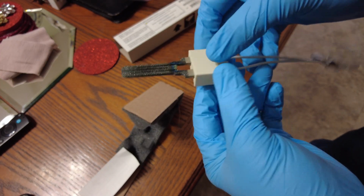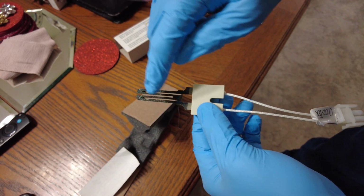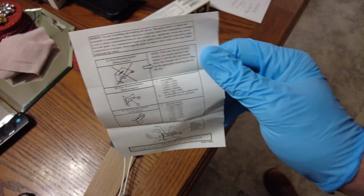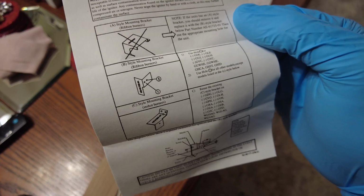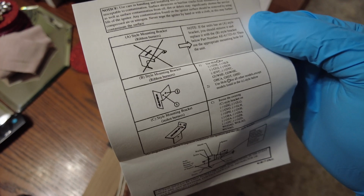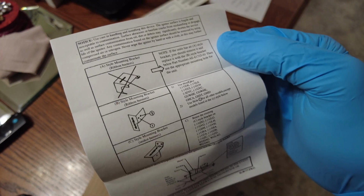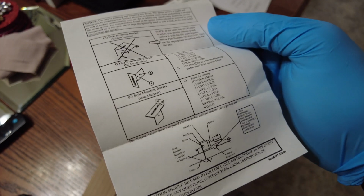But there you go. Now, if you touch this right here with an ungloved hand, you're going to shorten its life by a long time. If you read the directions, the igniter surface is fragile and susceptible to contamination. Any kind of contamination should be removed with nitrogen. Never wipe the igniter by hand or with a cloth, as this may further contaminate the surface.